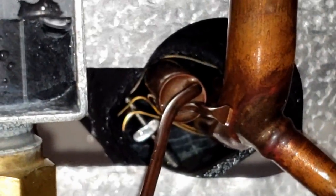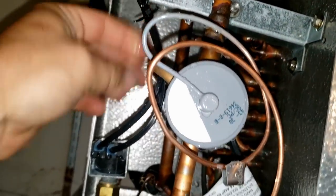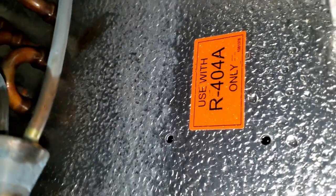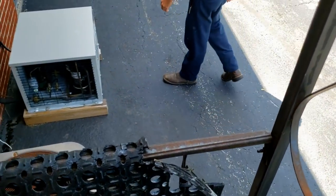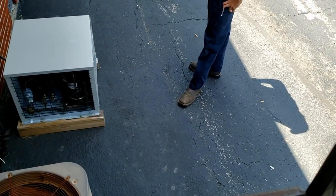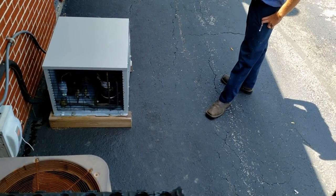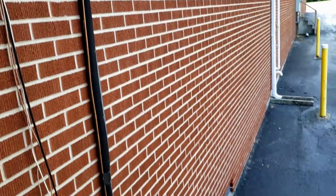Looks like good contacts on the side. The refrigerant numbers are a little bit faded but it says R-404A on the inside. I'm confused because it says factory holding charge — helium slash dry air — and designated refrigerant 404 or 448. What they do is use helium because its molecules are super small, making leaks easy to detect with a helium detector. They put helium in and the dry gas displaces any possibility of moisture condensation setting in the warehouse. Not the prettiest install in the world but it works.